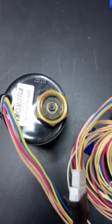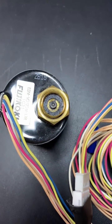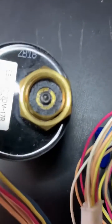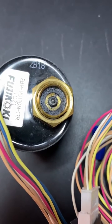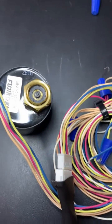And actually in this case it is driving it. So you guys need to use caution. Check your expansion valves with your meter first. Before you assume, just go grab the EEV Mate. And also make sure you check those valves to ground.